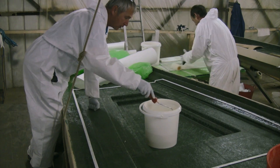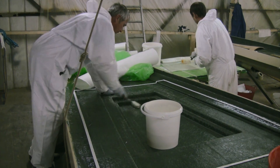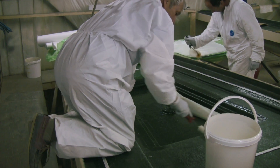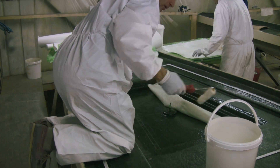We're putting in extras onto the mold tool basically so that when we actually come through with the big lamination run it makes it a lot easier. We're not trimming and trying to get around all the details. We can then just put down big rolls of glass that have been impregnated on the mangle and get the core on and get it back down in as short a time as possible. So they're doing the little details here.